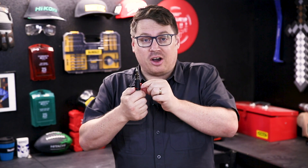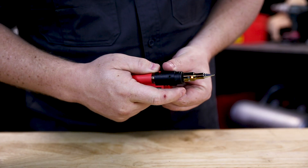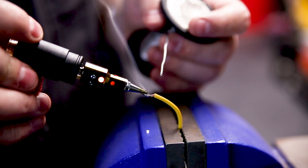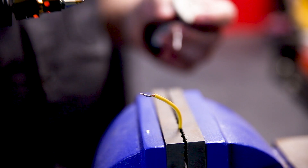To ignite the iron, you switch it on and pull the trigger until the catalyst heats up, at which point you can release the trigger, set your temperature, and you're ready to go. I turned it off between uses and because the catalyst stayed hot, I could just press the trigger to restart the iron — that way I got a lot more runtime than just the continuous burn.